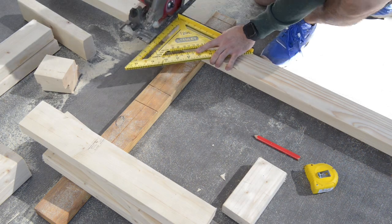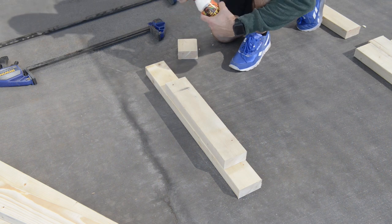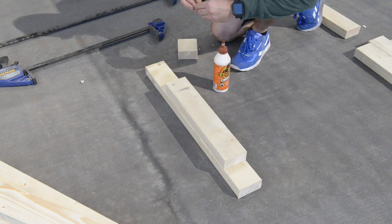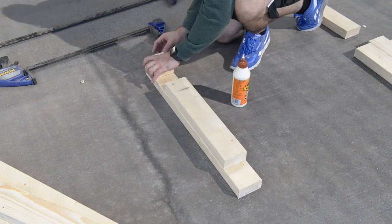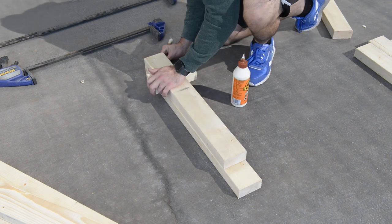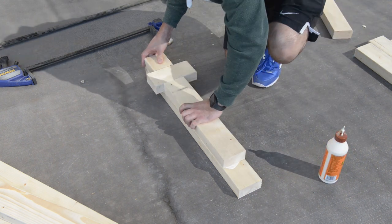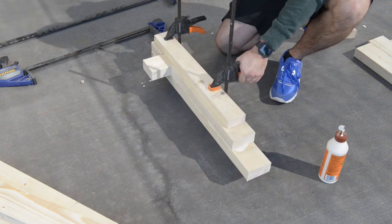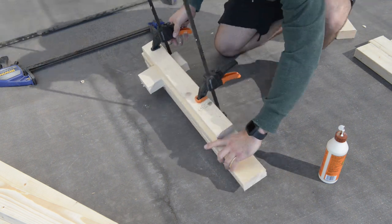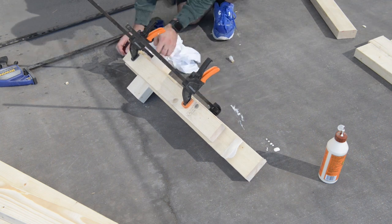For the glue-up process, on one side of the leg will be the long piece, then glue a little piece on the bottom. Then using a scrap piece, make a 90 millimeter gap, then glue the longer bit down, which should leave you with a 90 mil gap at the top. I'm in need of some clamps but for the meantime I'll just use what I can find. After that I did the same glue-up with the next three legs, making sure to wipe up any glue with a rag.